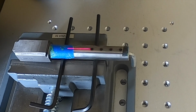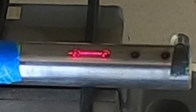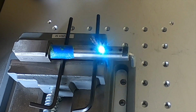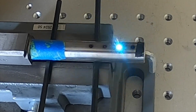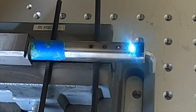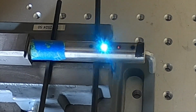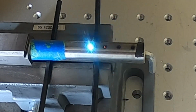We're about to start the second round of 10 global passes after reducing our focal distance, and you can actually see the little nubs in the center of the circles where that's the material left over. Pretty cool. The next clip is very towards the end of the second round of passes, so we are starting to see things start to break through and tilt and get hit by the laser. Since these little nubs in the center are so small, they'll actually take a lot of heat and glow really red, so you can really see the final tilt happening on barrels.